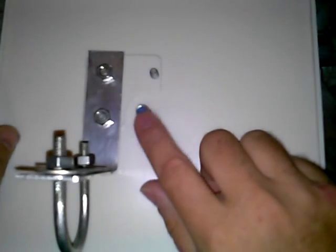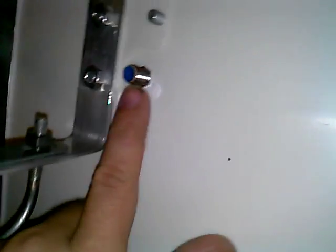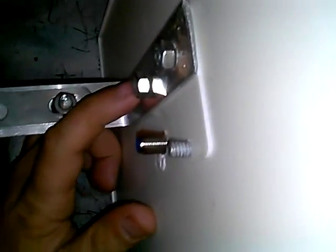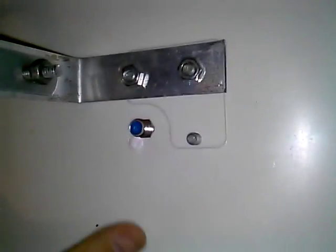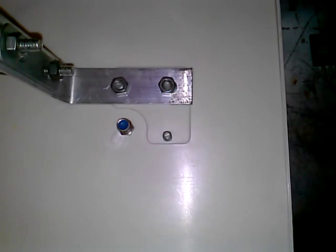What really got me was this connector here. When I first got this and saw this connector, I thought it was an HD antenna for television, because this is an F connector — a 75-ohm connector. Everything I've used in Wi-Fi has been at least 50 ohms. I don't know of any 75-ohm F connector cable used in Wi-Fi, and it came with a run of cable.